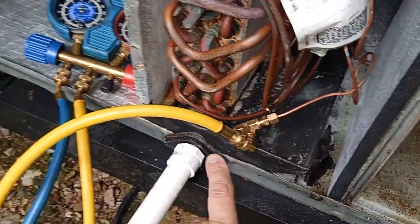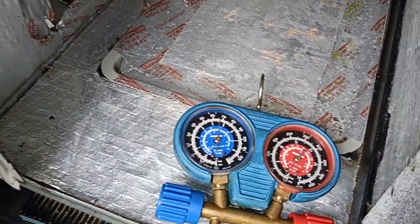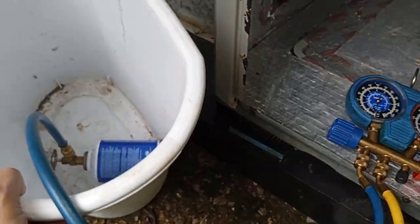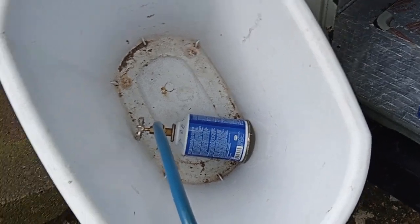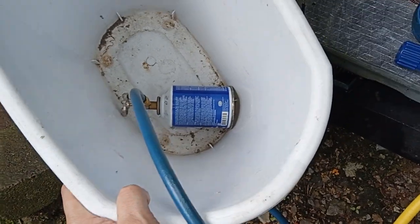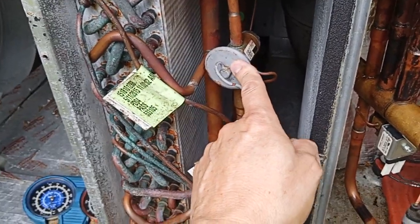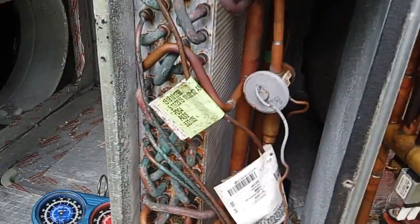For the refrigerant gauge manifold, there's a gauge at 67 pounds, supplied by air from an old R134 can with the dispensing valve that I had to rebuild because I lost all the refrigerant. But using air pressure to bias the diaphragm of this TXV, and I can feel cold now.